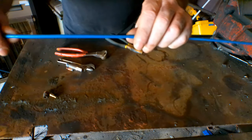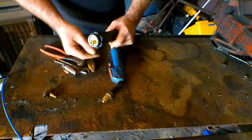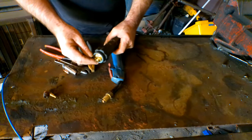We come up to the insulator — that's pretty good actually. It must have just been that one kink in the wire. So we won't reassemble the gun end just yet — what I'll do is feed that liner back in here and then put it onto the welder, run some wire through, and then put the fittings on the end. That way we'll make sure we haven't got any more snags. I'll go down until I can't go down anymore and then I'm going to have to straighten out this lead again. See the difference? Just straighten it out and it goes straight down — that's how important it is to keep the lead straight. Now if you've got a plastic or a brass nut thing that goes over there, put it on. This is just a plastic one — I just do it finger tight. So we've got our liner back in, we'll go and hook it back up to the machine now and run some wire through it.